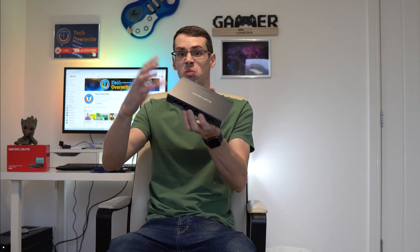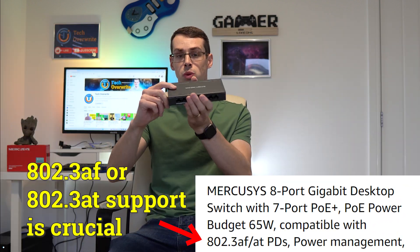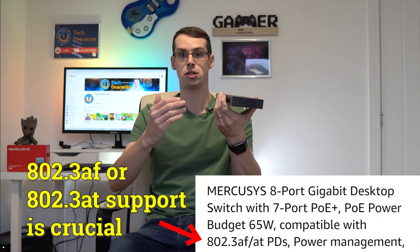So that proves you can plug normal devices into a powered Ethernet switch without any problems. But why is this, and are there any dangers? Yes — it all boils down to how the Power over Ethernet is implemented by the actual switch itself. A proper PoE switch will first negotiate with the plugged-in device to agree on whether to just send internet data or power as well.